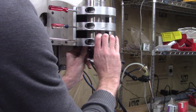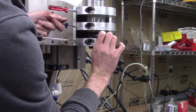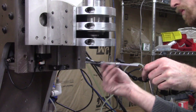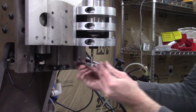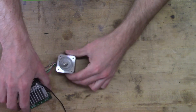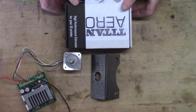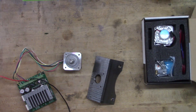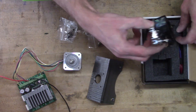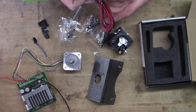I moved the spindle to make tapping these existing holes easier, but the spindle will stay put even when I'm using this as a 3D printer. Now to assemble the head. These type of 3D printers use a stepper motor to turn a hobbed gear which draws a filament of plastic through the mechanism and into a hot nozzle with a very small hole which deposits the molten material. It really warrants its own video, so for now just enjoy the assembly.